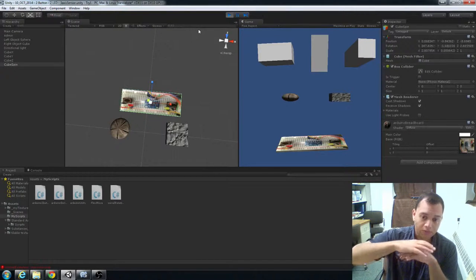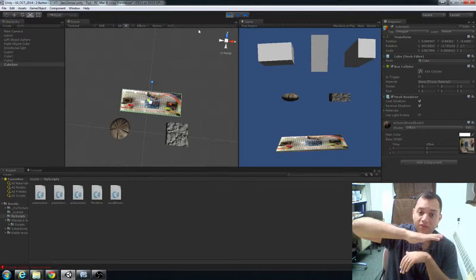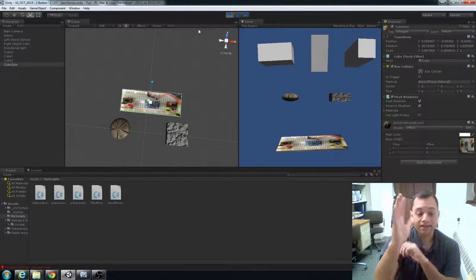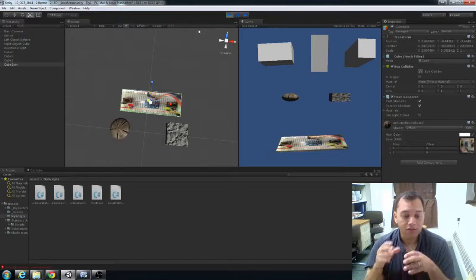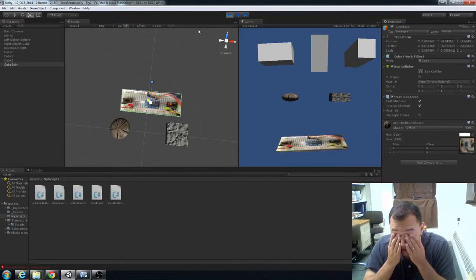And so what's going to happen with the accelerometer especially is if I have my hand like this and I rotate it this way, the accelerometer is not going to be able to track that. So if I have the hand like this and I rotate this way, which is now a different axis compared to the chip on my wrist, because I'm rotating it around the Y, or normal plane Z, then you're going to run into issues with it not being able to track it. So I have to get a gyroscope to play with that, and then I'll probably use that in coordination with the accelerometer.